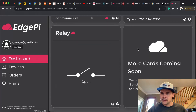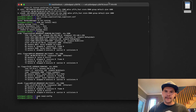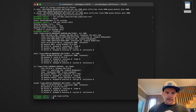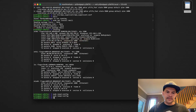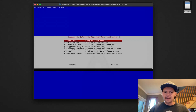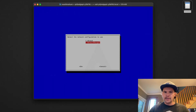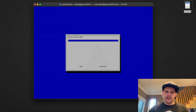I wanted to SSH into the device to connect it to Wi-Fi. On the side of the EdgePi there was an SSH command I could use. I ran into a snag: running 'sudo raspi-config > System Options > Wireless' said 'no wireless interface found.' The fix was going to Advanced Options > Network Config and changing the network configuration tool to NetworkManager rather than DHCPCD.